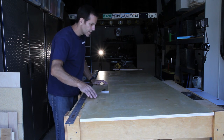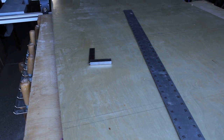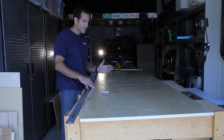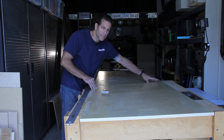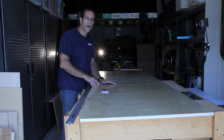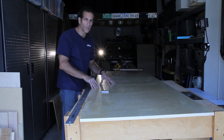I've marked out all my layout lines for my shelves. Now I'm going to cut dado grooves into these panels for my shelves. I'm going to run one series of dados — this panel isn't 15 inches yet, but I'll run the dados through it, then slice it down in half and it'll give me my 15 inch dimension for both sides of the bookcase.